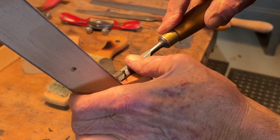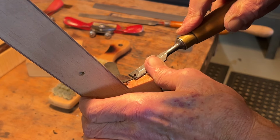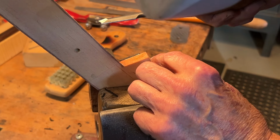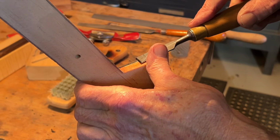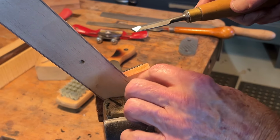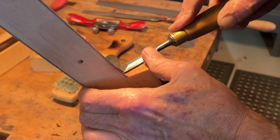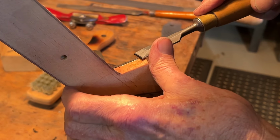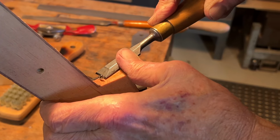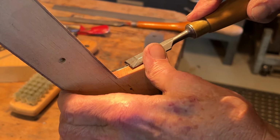And just like the other side, that is the treble side, when we were trimming down to the J, we're going to leave a little bit of extra material here. And it's a little bit easier to do the final cutting on this surface, which will, when we're all done with it, have a layer of ebony veneer on each side. Could trim it down all the way now, but I think I'm going to leave just a little bit to go.